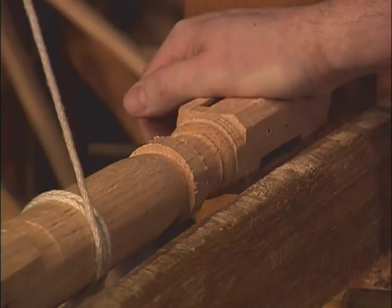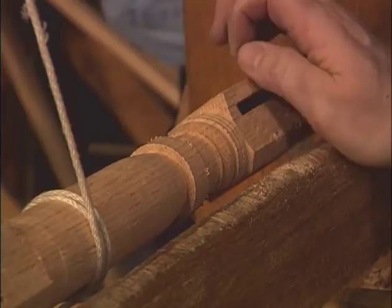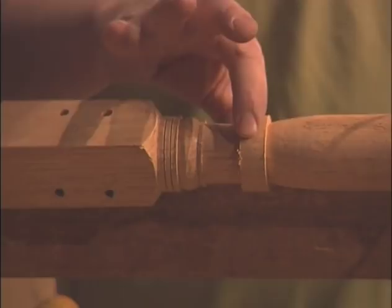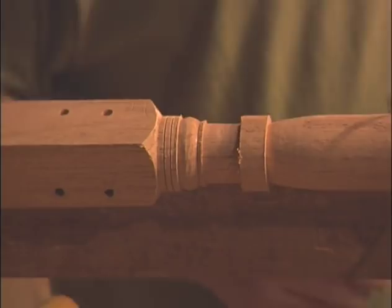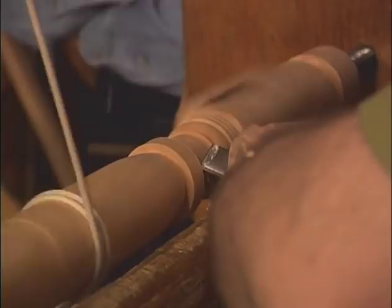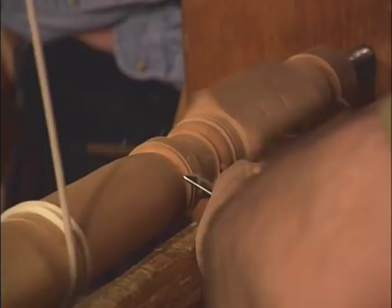So what I've started to do here is define some of the decorative elements — there's just this funny little bead and some cuts down below it, and that's going to turn into a bead. Most of this I do with the small skew chisel — just hope and pray that it works. This is pretty much done by eye. This sort of thing is not for the timid; it's best to just dive in and hope for the best. Because this is now going in the stool no matter what — it's got all its mortises cut.